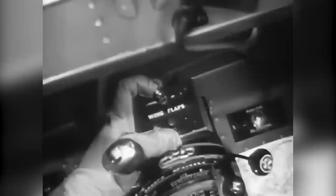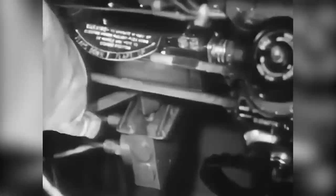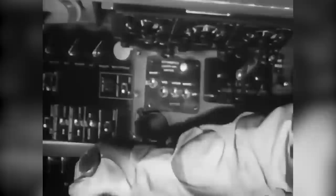The control switch is pulled back to lower the flaps and pushed forward to retract them. If the electrical control fails, you can manipulate the flaps manually — be sure the handle is depressed before moving the lever. If necessary, use the hand hydraulic pump at the right of your seat.